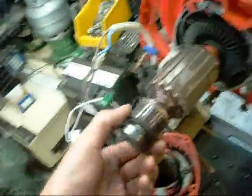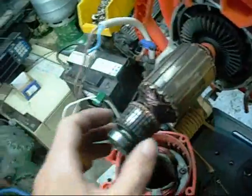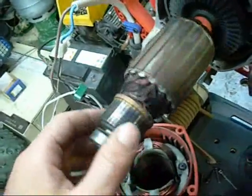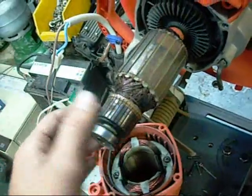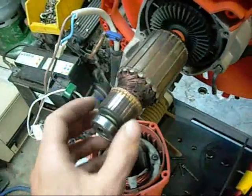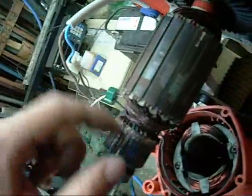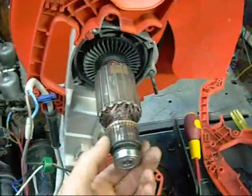The rotor is looking a bit sad — it's got a burnt spot there and there. So it could be that one winding going through it that's shorted. It's burnt into the insulation down at the base of the commutator bar and there are signs of them getting very hot. I really need a device called a growler to test this — something must be short inside that rotor. Everything else is intact, but those wires coming off look a bit black too. There will just be one winding inside that whole armature, but the whole thing is going to have to be chopped up and rewound from scratch.